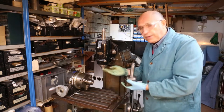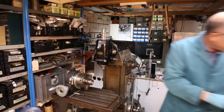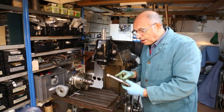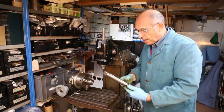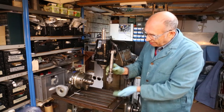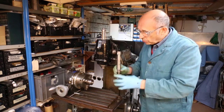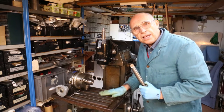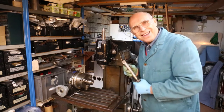One of the disadvantages, at least for me, of having a number four Morse Taper concerns my drilling chuck. My drilling chuck has a number two Morse Taper on it. I could put on a sleeve for number three, then another sleeve for number four. If I put that in the vertical head you can see it comes quite a long way down. The Alex is quite small and there's not much distance between the bottom of the vertical head and the table, so I can't use this chuck in the miller machine.